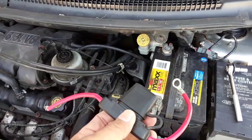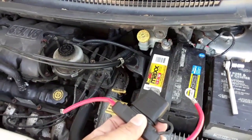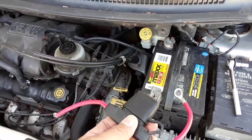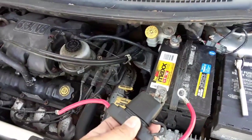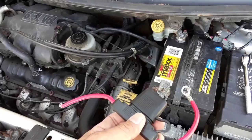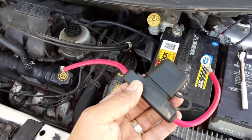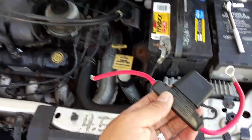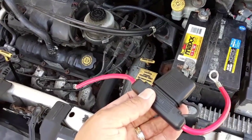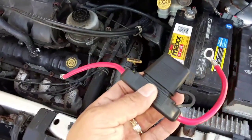On the other end we're going to attach it to a 10 AWG wire. The other day I suggested picking up a cheap nine dollar jumper cable because that's a 10 AWG wire — it's a cheap way to get it for about ten dollars. I went ahead and bought actual 10 AWG wire and spent like fifteen to twenty dollars for it, and I wish I hadn't because it's a lot thicker, heavier, and less flexible than a 10 AWG jumper cable. If you're doing this yourself, you might want to use a jumper cable instead.